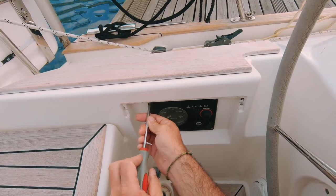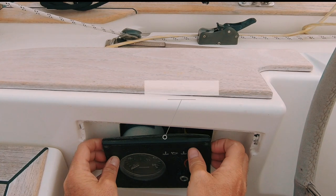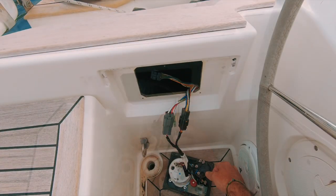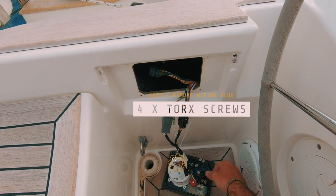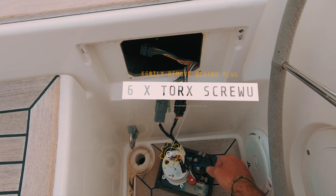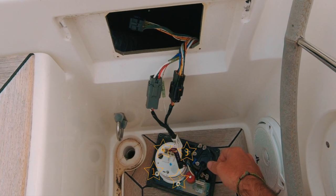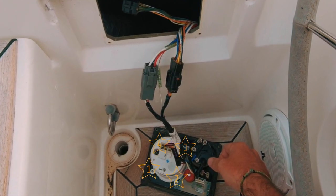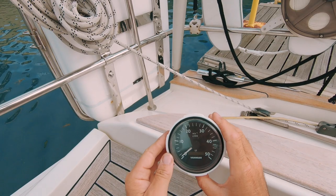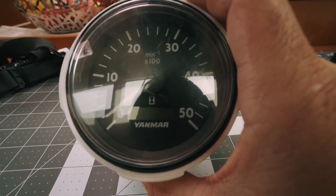Access to the back of the engine panel is relatively straightforward — four Phillips screws hold the panel in place. Be careful as there is a rubber gasket, and if it has been in place for a while you can accidentally tear it, so gently remove the engine panel. The rev counter, which contains the LCD engine hours, is held in place by four Torx screws. Remove these and put them somewhere safe, then remove the wiring loom gently by pulling it from the back of the rev counter. Once done, you will be left with your engine hour meter with the broken LCD.